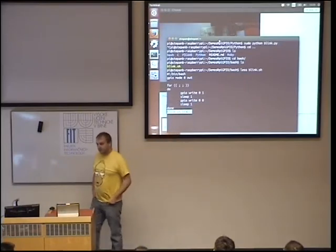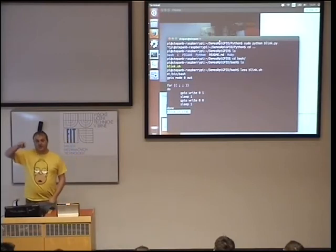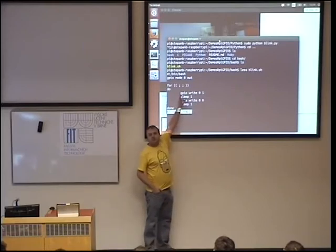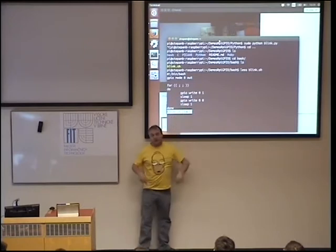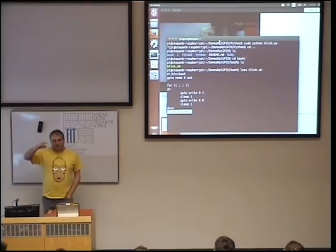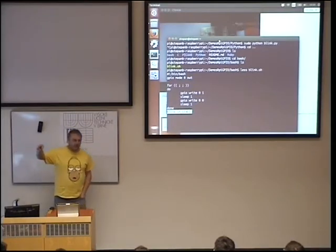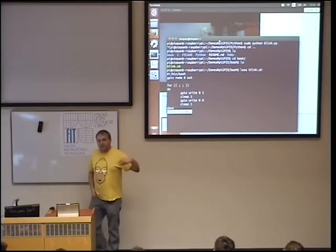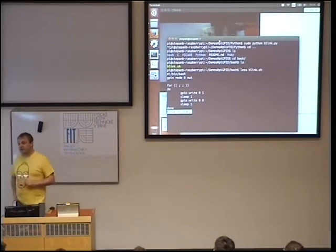When you install the C library, which is called WiringPi, then you will have a couple of simple tools to control the pins. This one, GPIO, is a simple application written in C. It's from the WiringPi library. You will see this library later today. So you can use the pins even from Bash. There are a lot of very small useful tools in the C library. It will do absolutely the same as the blinking diode using Python.